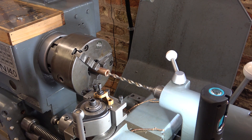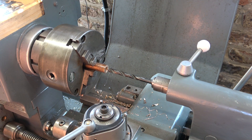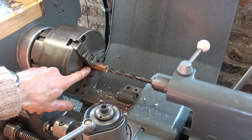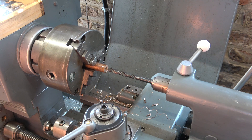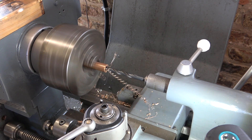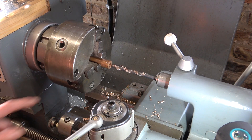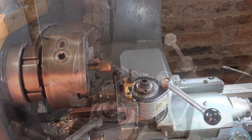Well, I still don't think that drill would win prizes but it's a bit better. Having got all the way through with the 8.5, I started to drill through with the 9.5 and it was just spinning in the chuck because the drill was getting seized and snagged in the work. So I'm going to use a 3/8 Morse taper drill now, which is near enough 9.5mm but it will grip much more tightly than I can get the plain shank drill to clamp in the chuck. That drill cut pretty well but it was still trying to seize up — I should have used an imperial drill from the beginning; they're much better. Next, to machine it to length.